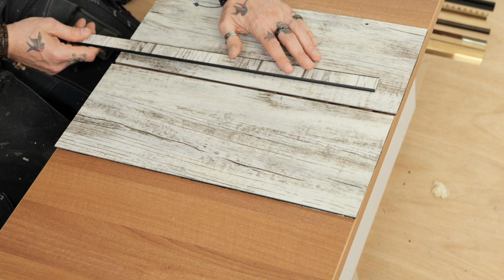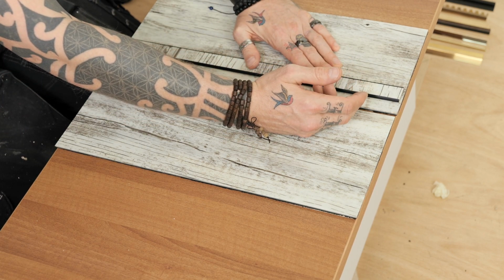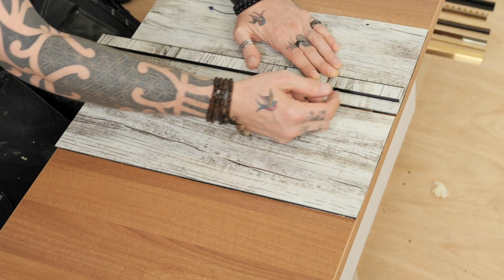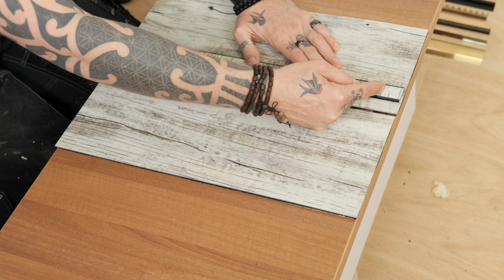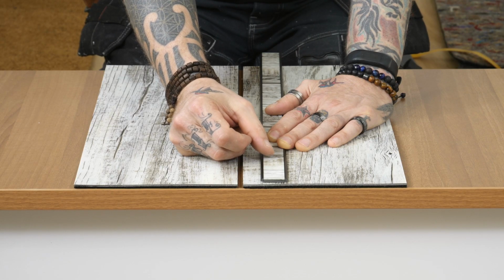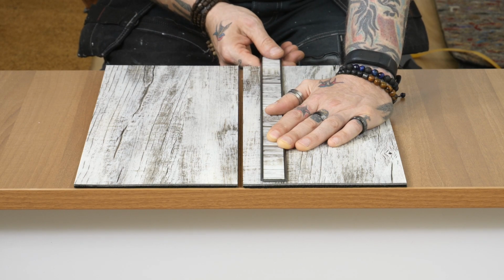An alternative to the floating cover is the Tramline Transition. The Tramline Transition is part of the New Alley range, and it gives you a tramline feature with all the profiles. It's got a 3mm recess in this one, but it does come in a 1mm and a 5mm. The recess has got a high grab PMR tape in it, so it's resistant against plasticizers, and it comes with a pre-applied tape on the back as well.